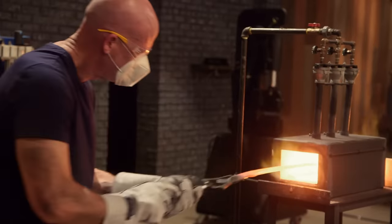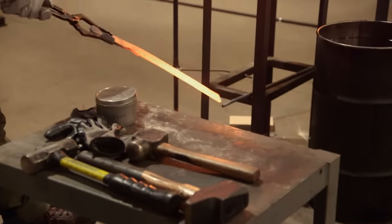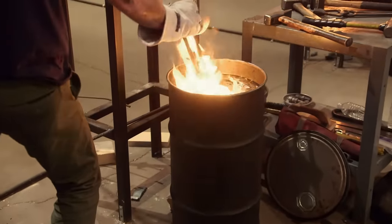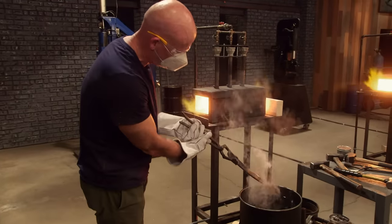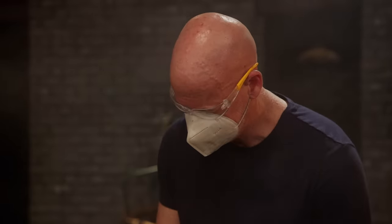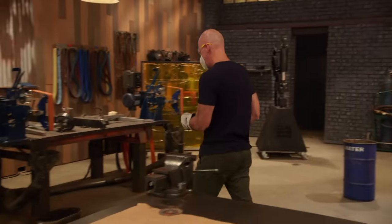Not hardened. This time, I'm going to bring it out a little hotter. There we go — nice color. That's the color you want to see. I pull it out of the quench, I hit it with the file. It's good to go. Thank God I'm finally done with that, and I can get on the grinder and remove some of this material.